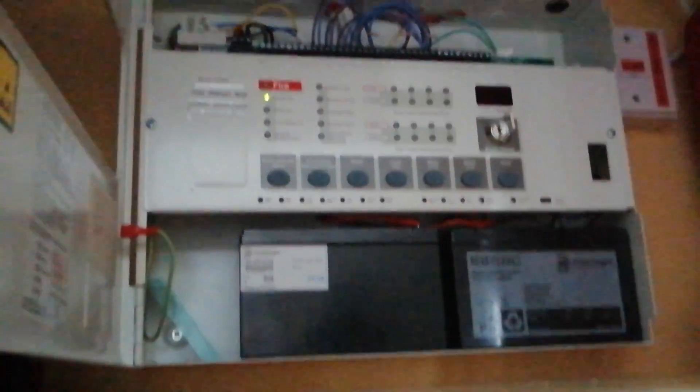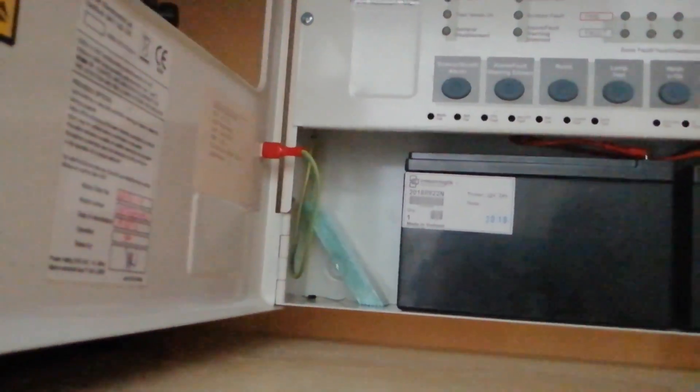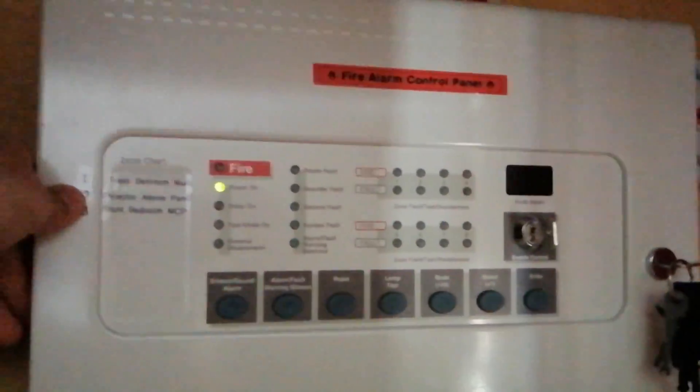It's a very nice control panel — I got it for a really good price on eBay, and it also came with a smoke detector, a call point, and some spare break-glass as well. For today we'll be testing all three zones. Zone one is the front bedroom multi-sensor, that's my ESP multi-sensor. Zone two is the smoke detector above the panel, which I've changed out for the sharp one. Zone three is the manual call point. The panel has no faults on it, which is good.